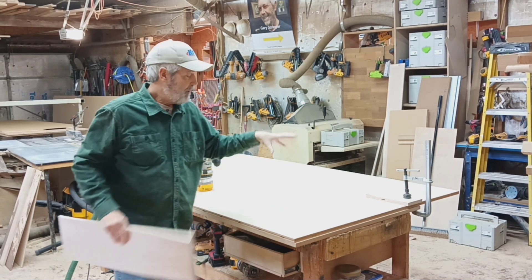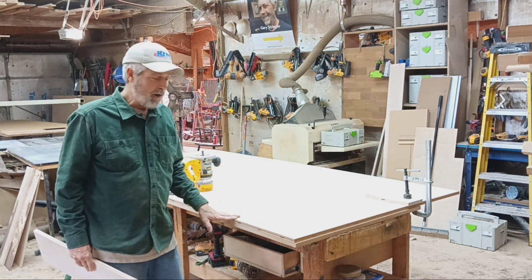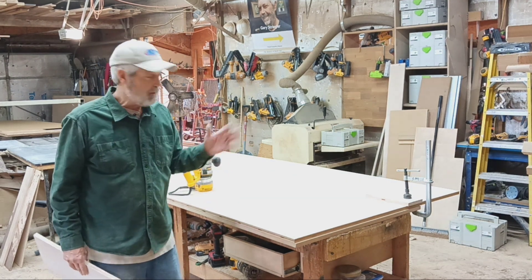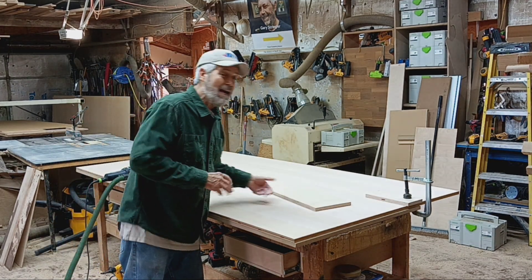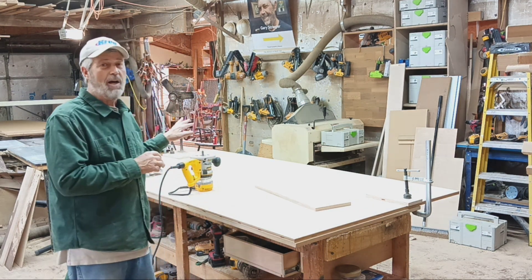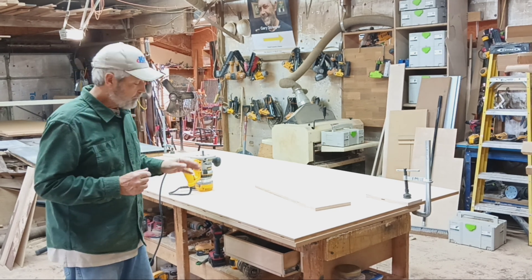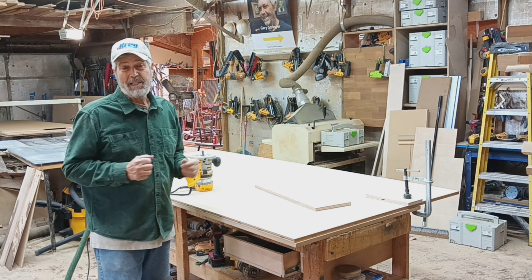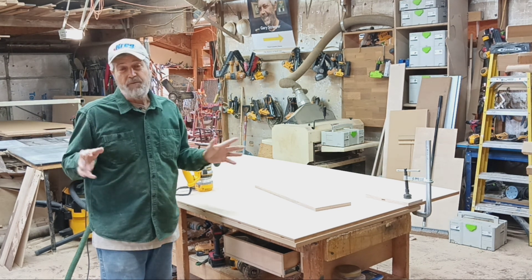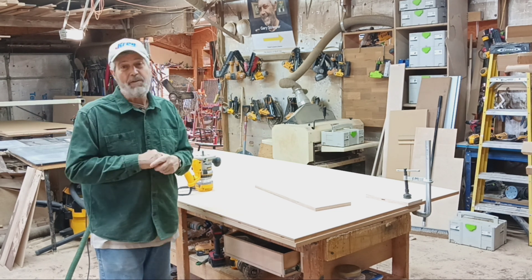For the pieces that are going to be joining - the partial rip, which in this instance is a 12-inch rip - I just cut that on a table saw to get a clean edge. But this 4x8 sheet is a little more challenging, because although I have a table saw that can rip to 4 feet, it's a little rough by myself to make sure I keep it nice and straight along the fence. If it tilts just a little bit I'm not going to have that really straight edge.